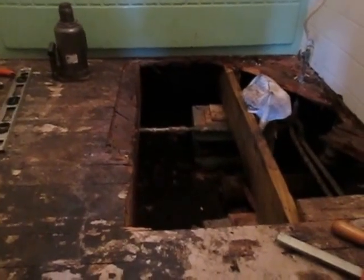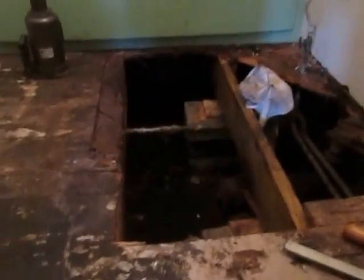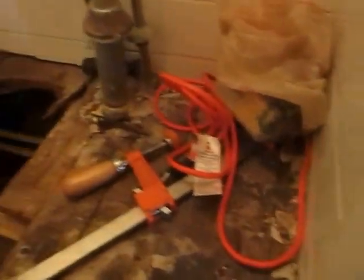All right, here we go — chapter two of the bathroom. My good friend Billy came over, and he's done a lot of this kind of stuff. He got down there in the hole and we got an eight-foot two-by-eight pressure treated board, ran it in — it's notched and meets up on the sill under that end. The wood was all dry underneath the tub, and the other end extends out into the hallway. We jacked it up, raised it, and added supports it never had before.